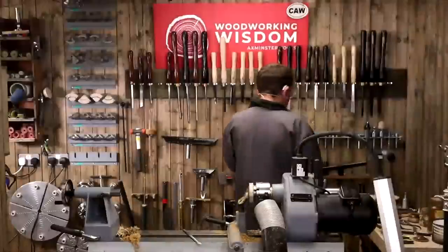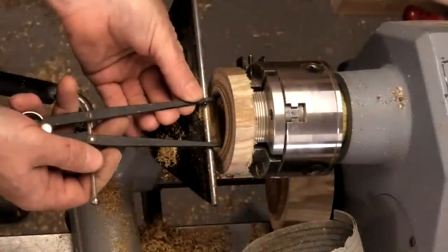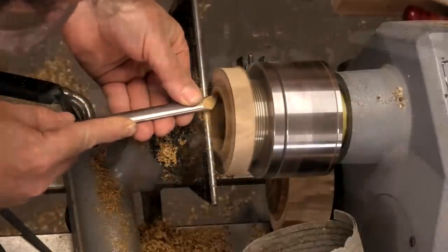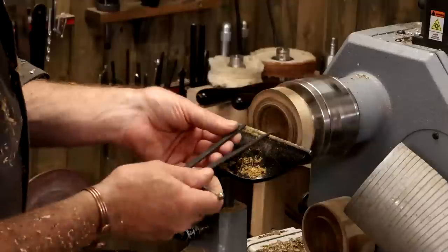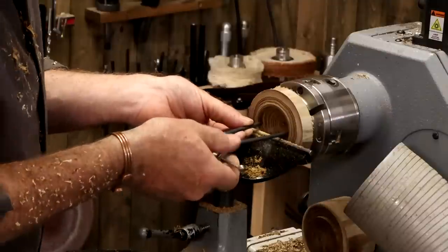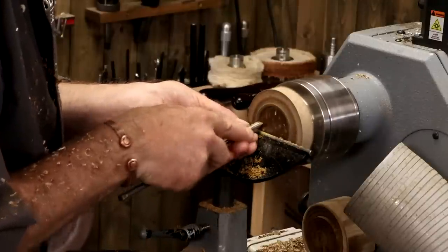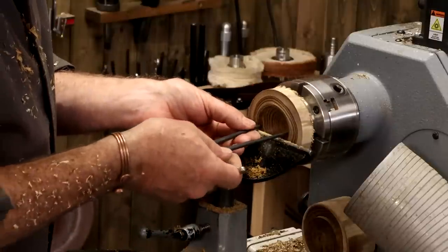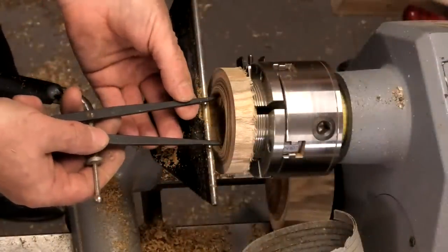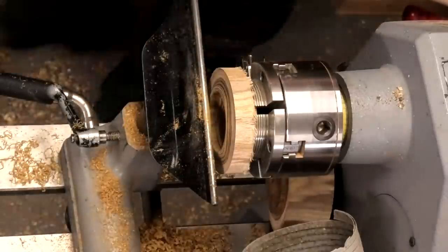As I get older I've got to start checking things. Set the expanding calipers into the back, come forward — I get a little wiggle there. Go into the back, setting up at center height, come forward — tiny little bit on the front. So I've got a taper going towards the back, I need a little bit more out. This is the secret of fitting a lid and base together. Running the calipers down like this tells you if there's any little lump or step you've left — if you haven't got one continuous straight cut you'll feel it pulling back out. Now pressure is equal as we pull down through — nothing suddenly jumping in on the calipers. This works well as a tip: measure it if you want it to be dead parallel and fit nicely. This stage is fundamental.